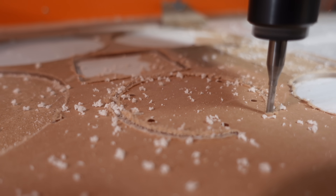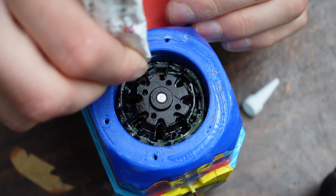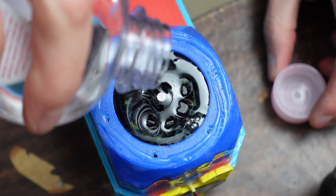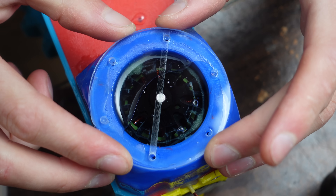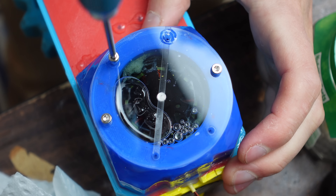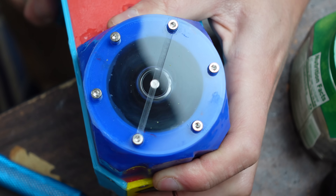Since with the FPV camera housing I learned that 3D printing alone was not waterproof, I smeared silicone all over the outside to seal it. I then cut more windows out of acrylic on the Stepcraft, did some silicone around the rim, and filled the entire thing up with mineral oil. Mineral oil is non-conductive, so it's fine to submerge electronics in it. My goal was to have the mineral oil take up all of the space inside so there's no room left for water to ingress. In theory, if the entire thing is filled up with oil and there's no air, then the entire thing can't be pressurized, so there will be nothing pushing water in. I wasn't able to entirely fill it up, so there is a little air, but oh well.